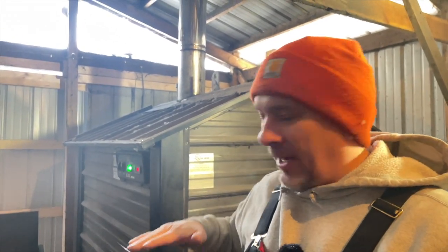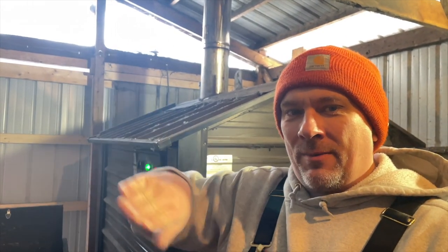Welcome back to a cold morning here in west central Wisconsin — it's two degrees, feels like 12 below. I came out here to do the morning fill-up in the boiler and want to talk about why I prefer using what some would consider smaller splits for a boiler and seasoned wood. I'm also going to clean out the ashes. I get asked quite a bit how often I clean them out — generally once the ash level gets above the rounded water jacket on the firebox, so about every week to ten days I'll scoop some out.